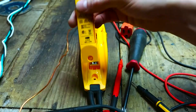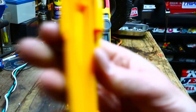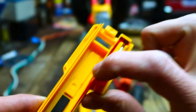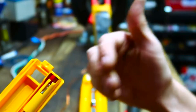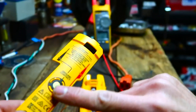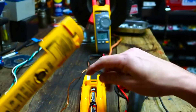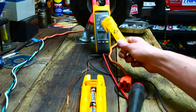I grounded myself out, touched this pad with the red lead in an outlet, and nothing happened. There's some kind of mystery going on inside this thing. It looks like it turns into a ribbon, and I'm thinking maybe it's a very tight inductive coil, so there is voltage induction — ghost voltage, eddy current — but it's not really there. It didn't hurt me. If I was legitimately grounded and there was 74 volts here, I would have felt that. But those ghost currents or ghost voltages don't hurt, you can't feel them, and they can trick a digital meter. They will not trick a mechanical solenoid-type meter, but they will trick a digital one — unless you get a really expensive one.